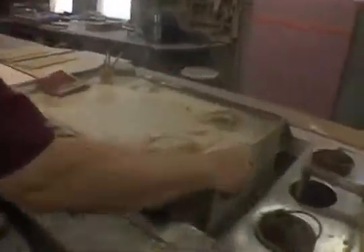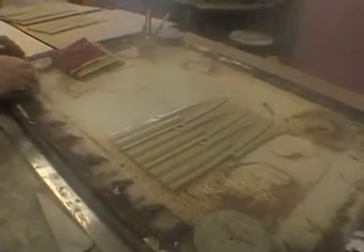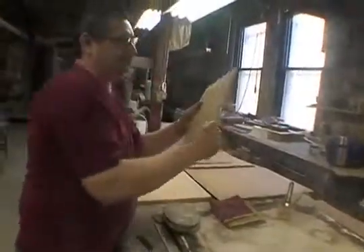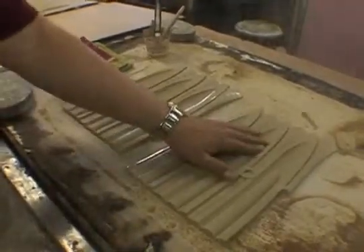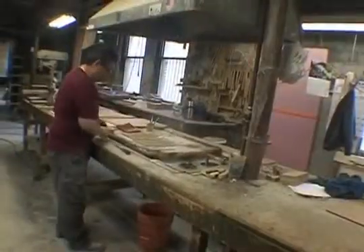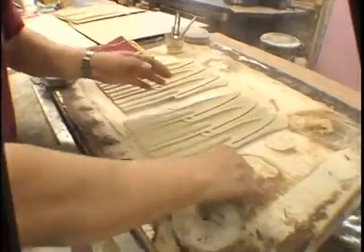Take the large compo ornament, dip the end in for a good seam when it's all put together, and lay that on the steam table. Steam that for about 40 seconds. Then take the second one, dip the part that's going to match in the boiling water, and lay that on the steam table as well. He's doing these two at a time — it could be done two at a time or just one. The key is to steam it enough that the glue is activated and you'll be able to close the joints up tightly.